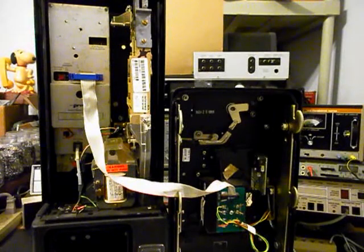Now that we have the payphone open, this gives you a look at the inside. We want to install a bell in this unit and a bell circuit, because these payphones do not have bells in them. We also want to install a modular line port so that Dan can simply bring in any line, any length, any color and plug right in. It makes for a simple, clean plug-and-play connection.